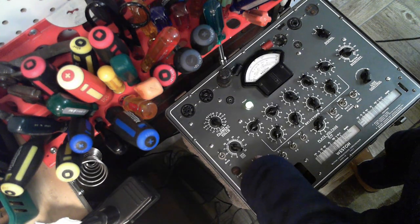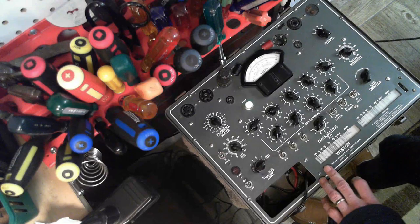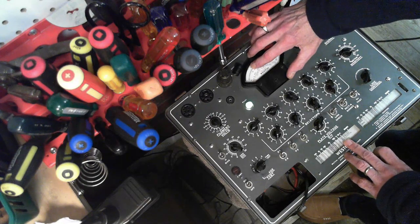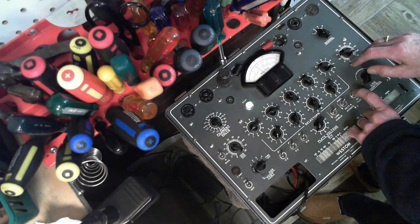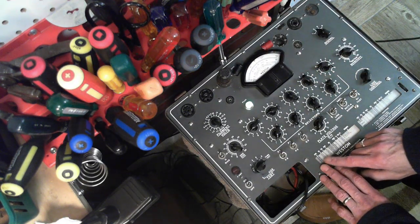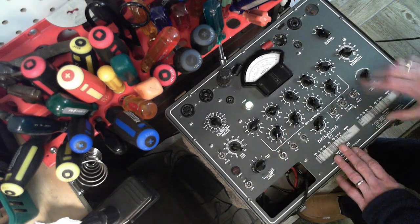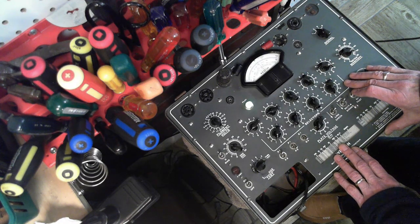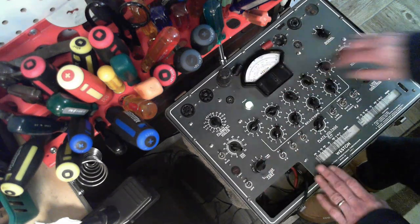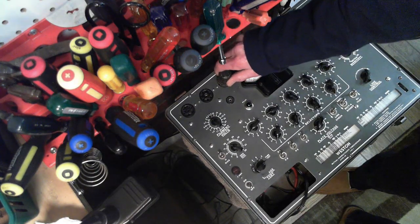Okay, look for shorts. This tube, to be good, has to come up past 880. 880 is about here. Okay, so we're quite a bit above. That's better than the other tube. And now the other half of this one. P1, G. Here we go, these two switches. Much better. Okay, that's all we need to do. I think this tube is quite satisfactory. Very good. Stick that in the radio here.